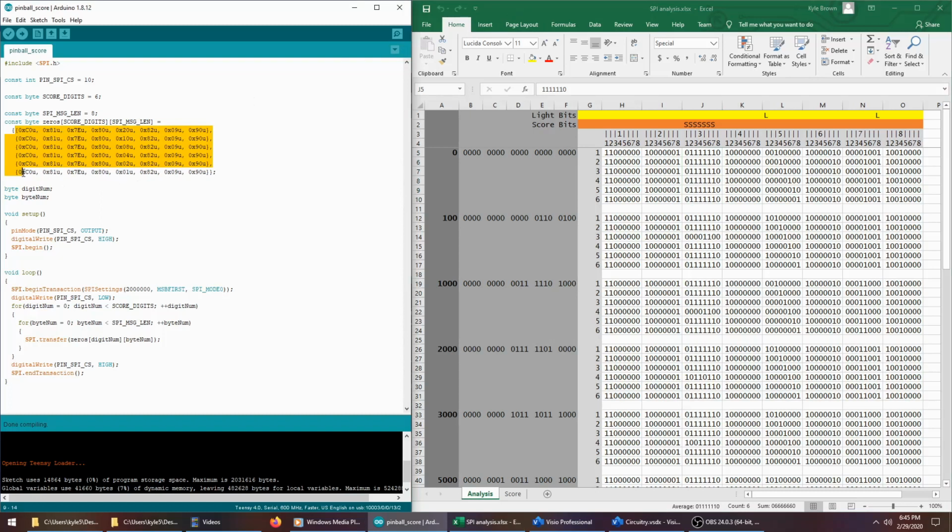So I've got 6 sets of 8 bytes each that I'm trying to send over the SPI bus. Setting up the bus and transferring over it is pretty simple. I designate one of my pins as chip select and set it to output. I start the pin high, so the slave is not activated yet, and then I take control of the SPI bus. There are a couple default pins on the microcontroller that are designated as the SPI clock and the SPI MOSI and MISO. So those default pins are used if I don't specify any other pins to use.